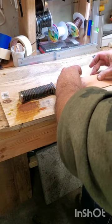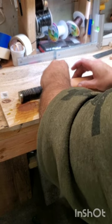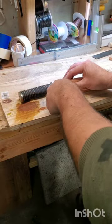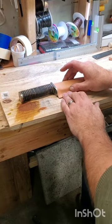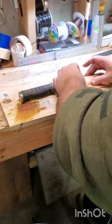And a real key here is that you got to trim your fingernails constantly. If you don't keep really short nails, you're inevitably going to stick a thumbnail in the side of one of these things when you're working on it and leave an impression that you won't be able to rub out.